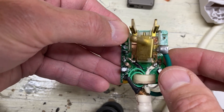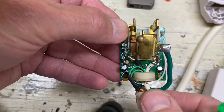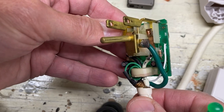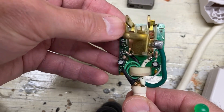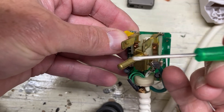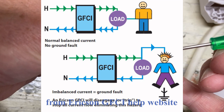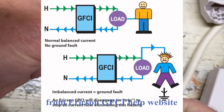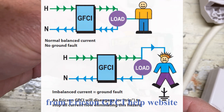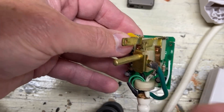Some of the components are obvious and others maybe not so obvious — one big surprise, which I'll reveal a little later. So GFCI breakers in general attempt to measure a difference in current between the two conductors. It assumes if there is a difference in current, that current is flowing through an undesirable, perhaps unsafe path like a human being, and stops the power flowing.